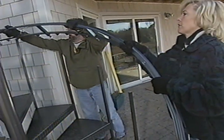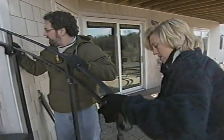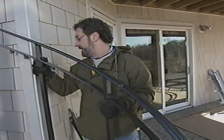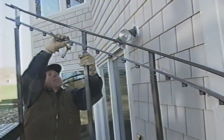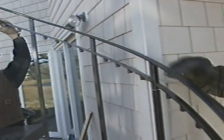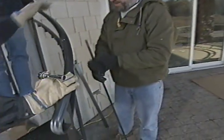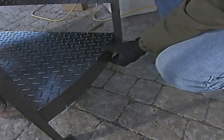Dave is all set to go on the next section of railing. This is the double handrail our assembler made back at the shop according to the dimensions you'd sent us. We cut it apart for shipping and now it's ready to basically slide into place. We'll put the other section on and we'll be done, except we'll add these spindles at the end. We'll put a little silicone on the top so they don't rattle in the socket, put it in the hole at the bottom, and the stair will be done.